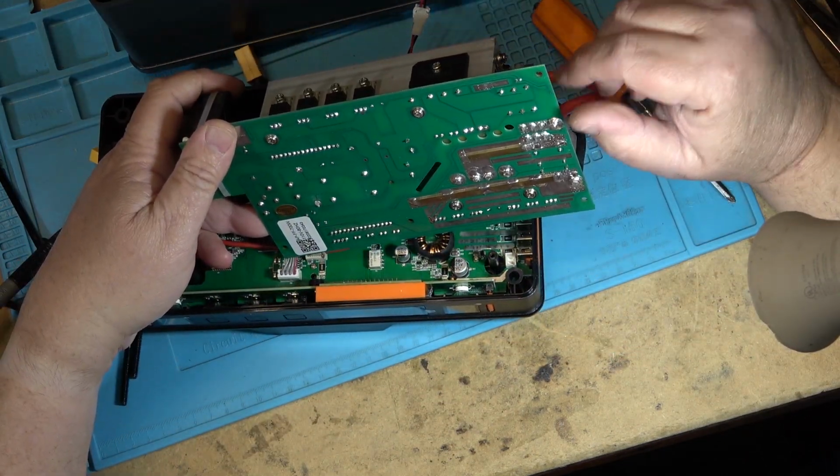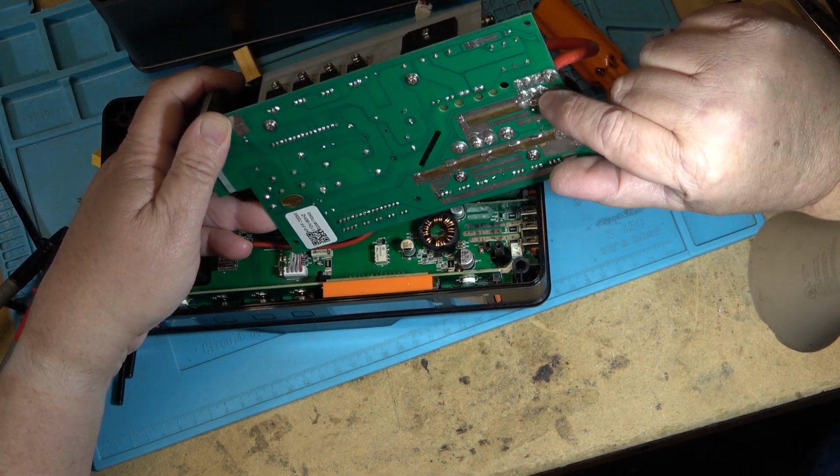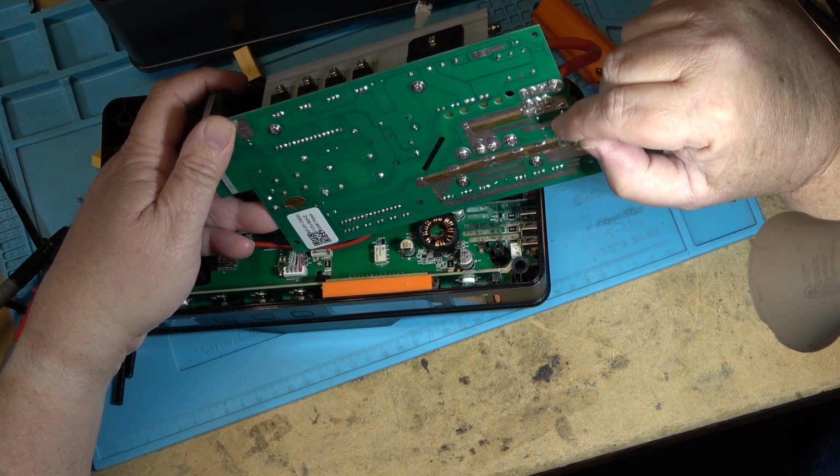Very important that you've got fuses on it. I'm glad to see that there's 2 fuses here. No, there's not a lot of separation between the 2 of them, but again, we're not talking high voltage, we're talking around 14 volts. So you're not going to have any arc over at 14 volts there.